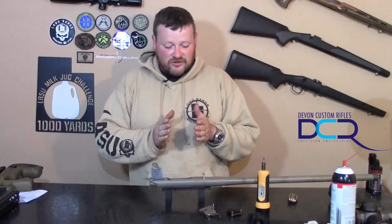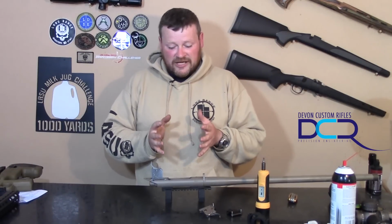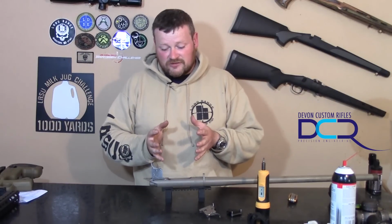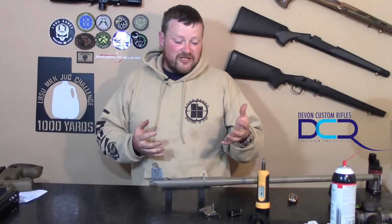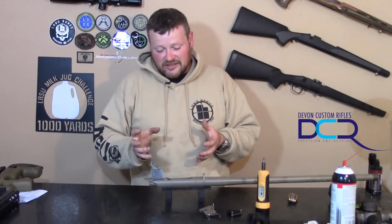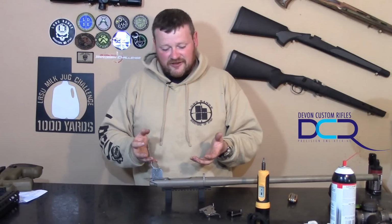But the two of them use this sear technology just really close to the pivot point, so you can have as safe as possible a trigger pull without having to compromise on the trigger weight, which really is the way forwards. Every better trigger that came out was moving the sear point closer and closer to the pivot until they get to this point here where it's almost perfect, or as perfect as it can currently get, while still being safe.